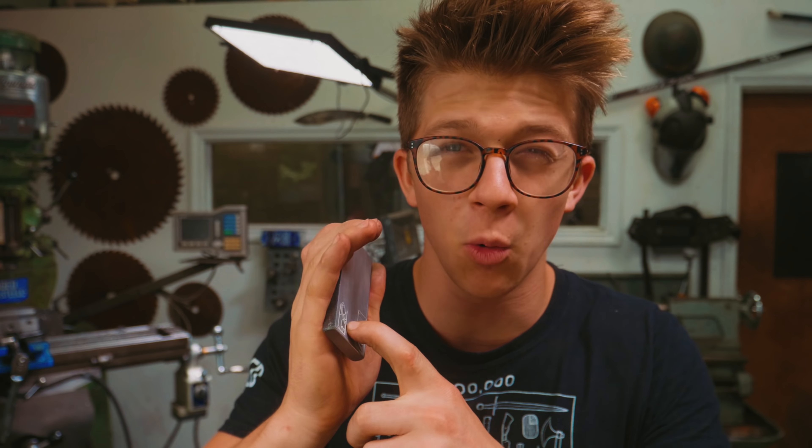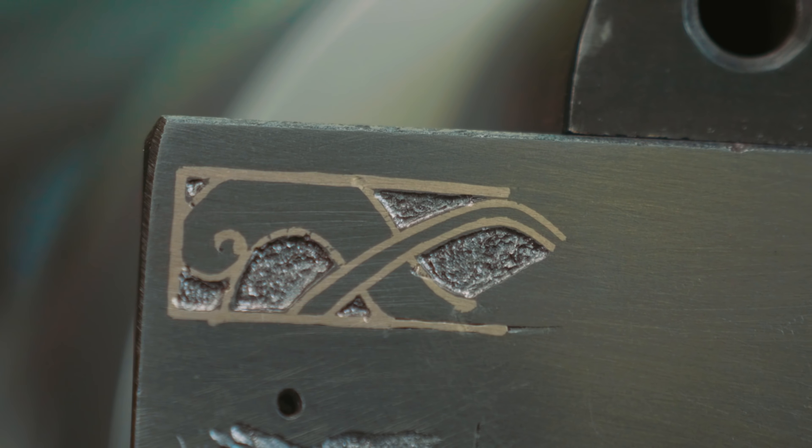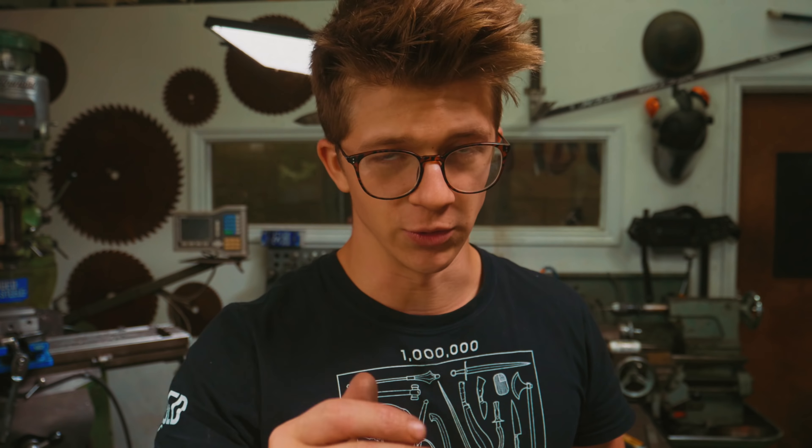This has been phenomenally educational doing this little practice piece. I'm happy with how it turned out despite all the mistakes I made — and happy because of those mistakes because I've learned a lot. I now know that sterling silver wire will dent the steel. I now know I need to use wire thicker than half a millimetre but thinner than a millimetre. I also know I can use a ball burr on my pendant drill to rough out the background, and that roughing out the background gives phenomenal contrast — it captures the light and helps make the beast stand out. I also know that making that background has its risks with a ball burr and it's very easy to slip.